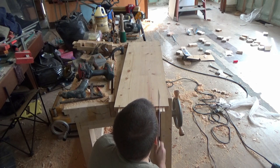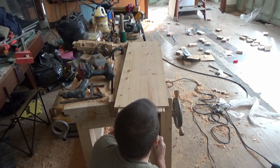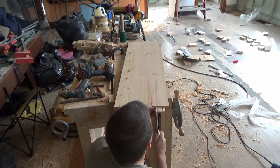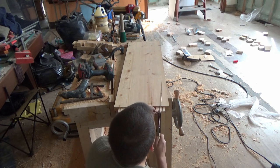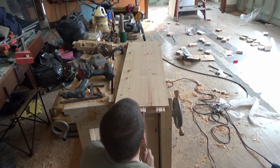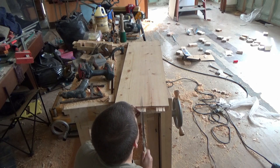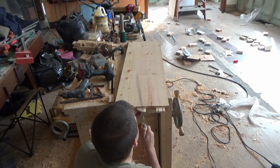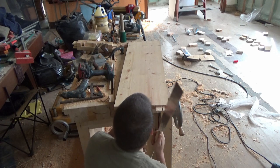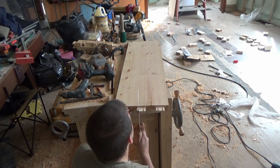The shelves were made — all ten of them — in the last video. In this video I've drilled out my anti-split measure; you always do that when you do a wedge tenon so you don't risk splitting the workpiece when you push the wedge in. I'm slicing the chamfer out here. You don't always have to do this chamfer, but I wanted a thicker, more pronounced wedge, so I went ahead and cut a five-degree chamfer into all of my tenons. I also felt that gave me a little more flexibility to really push the tenons in there.